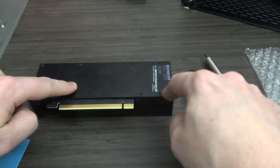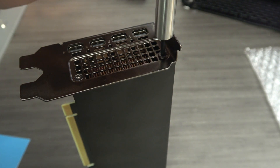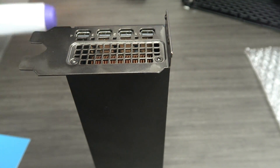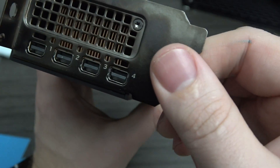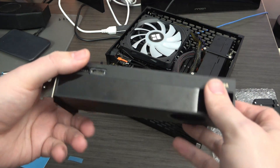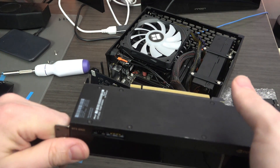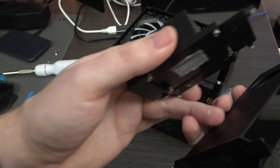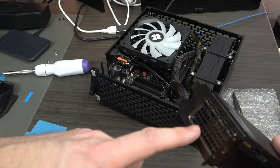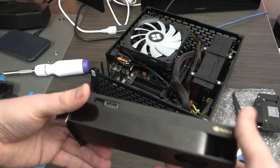Get the final back screws in to put the whole thing back together. Looking through the interior you can actually see the copper poking out, which looks pretty cool. The card is now very hefty with the copper heatsink installed, but that extra mass will sink a lot of heat. Combined with the increased surface area and the fan blowing across it, we should see dramatically better temperatures than the stock aluminum heatsink — and we'll test that.